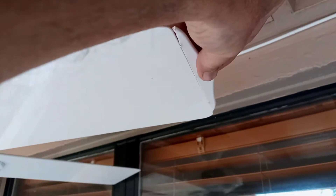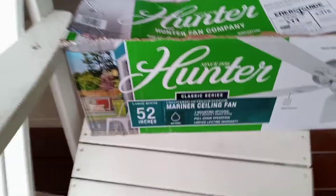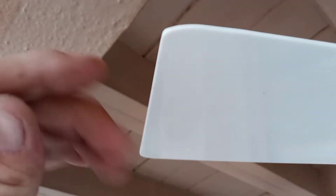I cut this off with a miter saw — a chop saw, DeWalt chop saw. By the way, Hunter makes really good ceiling fans — can I get a sponsorship, Hunter? I love y'all. So I cut this on a miter saw. It's really made for wood, but if you have a fine blade it'll cut this stuff. You want to go real slow and you actually want to cut it from the back to the front. Don't cut from front to back or it might pop and jump.